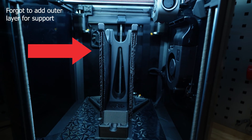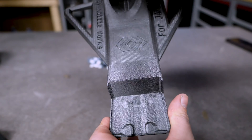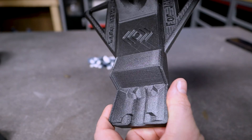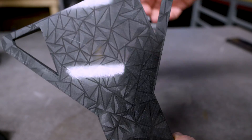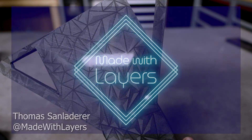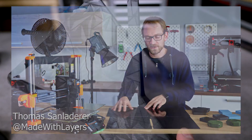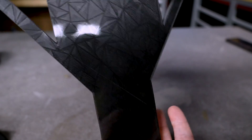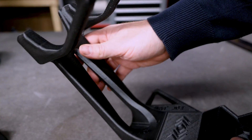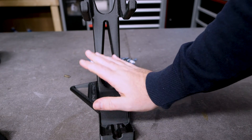The nozzle worked very well with this carbon-filled PETG, and if you want to download this design it will be available in the Saturn 3 Ultra review. Also worth noting, on the Creality K1 you can now buy many different flex plates — I'll link a video from Thomas Sandlader covering all the options. Even the carbon-filled print has a nice surface effect on it. The overhangs and bottom surfaces all look great. This is just a really cool print with this nozzle.